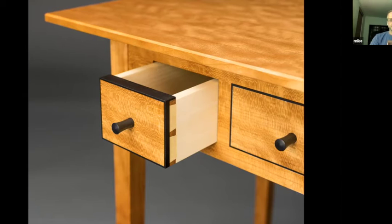When you cut your board into three pieces to make your drawer fit, did you use the cock beading to take up the space lost to saw kerf? You always lose an eighth or three thirty-seconds with your saw cuts. Yeah, there's no way around losing some material due to saw kerf. But no — when everything was glued back together, it wasn't a perfect representation of the original board, but we lost some material in the kerf and when I glued everything back together I glued it so that the drawer fronts I had extracted fit in the opening pretty much perfectly.